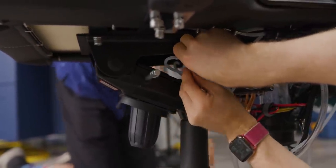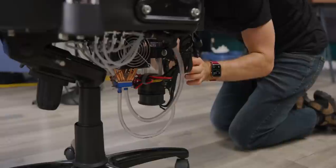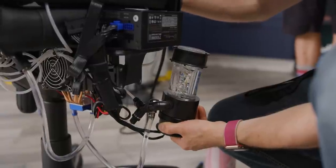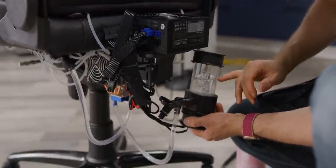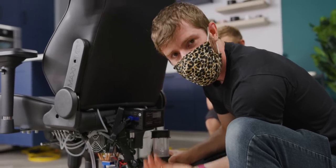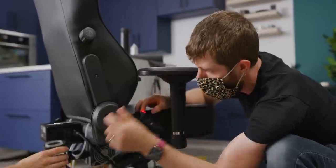Your next step is to drop the reservoir out to fill it. Careful — it's 3D printed. 3D printing: great for most things, until you put a Linus in the equation. Moment of truth. Something to note is that we have a barbed fitting with no collar and no zip tie on it — that's not best practice long-term, but we're just trying it. We haven't shown you the switch yet. This switch controls the power supply, which is jumpered — you connect the green and any ground pin on the PSU — allowing us to power up the supply without a computer.